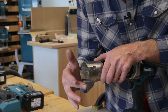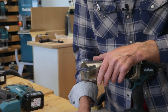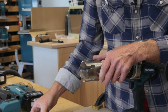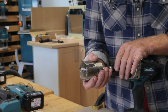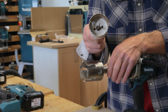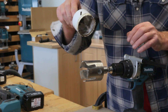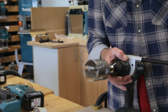It's got these very sharp little carbide tip teeth, the same sort of thing that you would get in a saw blade, but in a round format. There are fewer of them than on a conventional hole saw, but they do a great job. Because there are fewer of them, the torque isn't quite so critical - it doesn't struggle in quite the same way and it doesn't overheat. It actually goes through like a dose of salts.